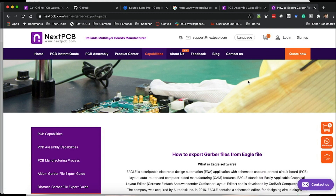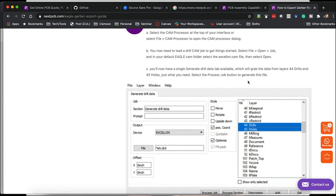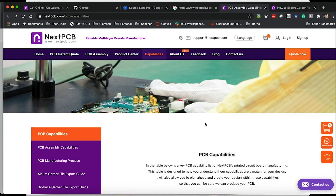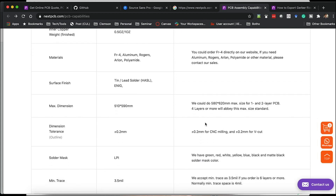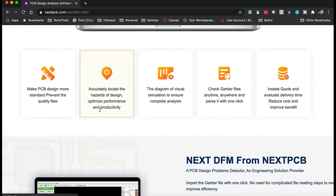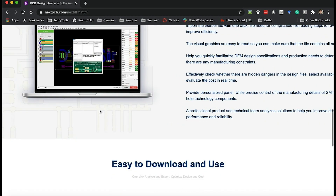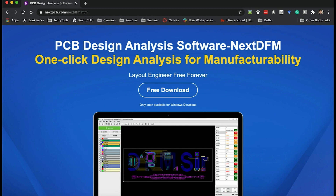At this stage it's really important to take a look at the manufacturer's instructions, because each manufacturer has different limits — they may limit how thin traces can be, how close together elements can be, and you don't want to put something in your board design that they can't actually make. Usually the defaults are good enough, but you want to be careful so you don't end up spending money and waiting for shipping just to find out that your boards don't work. One other really cool thing is that NextPCB offers their own free analysis software called NextDFM. It's free, it checks your design files for you in case you missed something in their limitations, and it will help identify errors before you order — which can save you time and money.